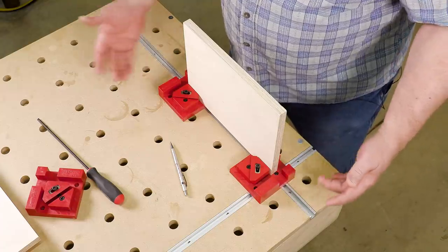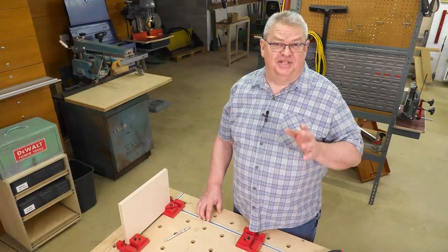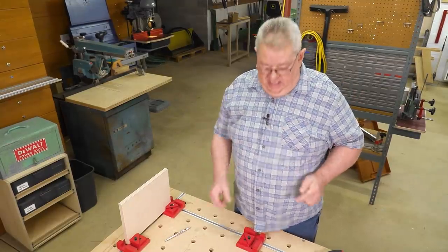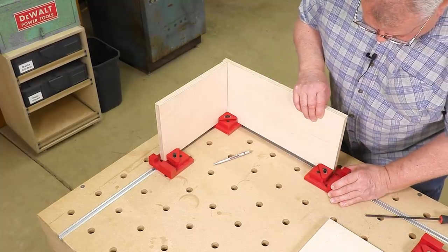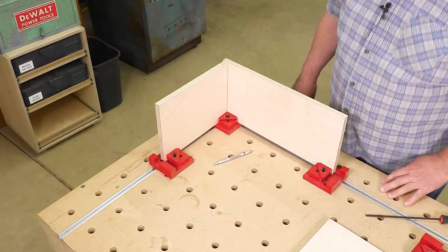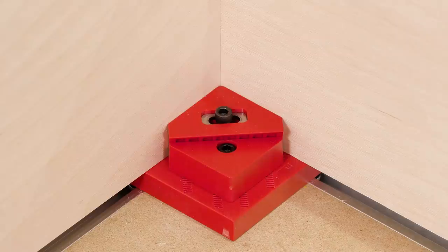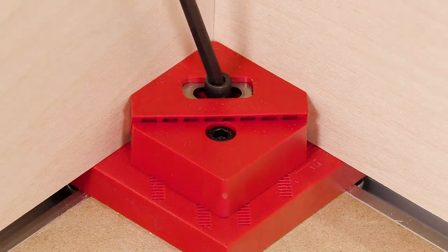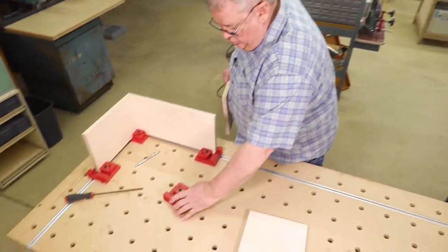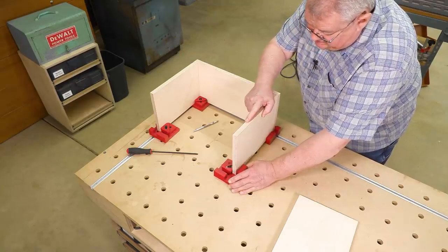This is square, so if I were doing this just loose on the table it could be going all over the place. In the track system I've got everything lined up. I swapped places with John and his camera so that you can see inside the box while we're working. Next we're going to take one of the long sides, slip it into the corner, and then adjust the tracked adjustable box clamp until it's about where it needs to be. You can see the corner doesn't quite come together, so on the outside I'm trying to make everything flush by hand. When I get it fairly close I'll start tightening down the wedge.